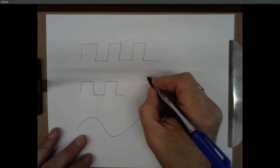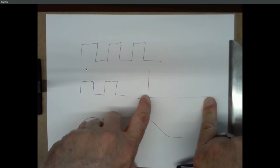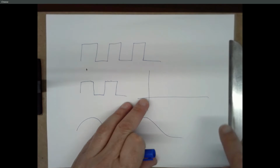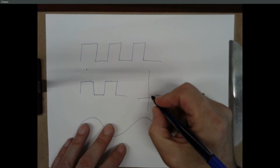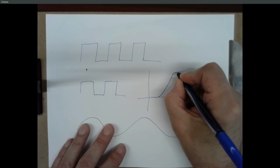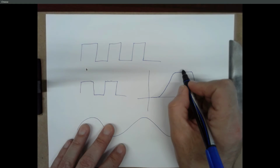Yeah, no, exactly. And if you were to look at this, there's all kinds of things you can do with the oscilloscope, and I can show you in lab sometime if you like. You can blow up different sections of it, and you can make it so that the distance from here to here is a few nanoseconds, a few billionths of a second, and that really lets you see what's going on. If you're toggling 100 times a second, and you're showing one square wave, this is about a 100th of a second. You can do much finer resolution than that. And if you were to do that, you might see that your waveform actually looks like this. This would be much longer.